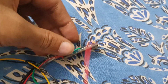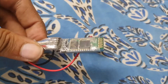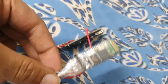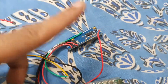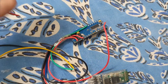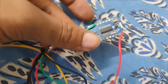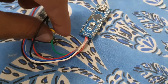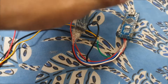For this project I have chosen the Arduino Nano as it is very small, so we won't have any problem placing it anywhere in the car. I have also taken the HC-05 Bluetooth module. As you can see, I have already connected the wires to them. Looking at the circuit diagram, I have connected the data pin to D6 for the RGB strip's data input.